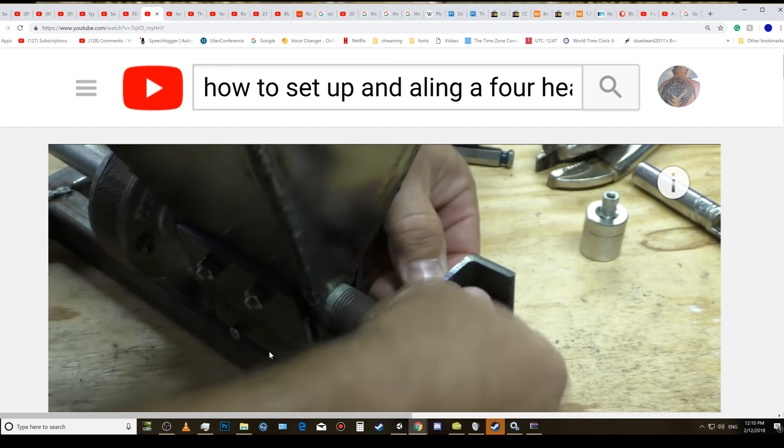You need the wood-style screw instead of the modern metal-style screw. These modern drills are designed for high speed. The old-style ones are designed to push a lot of product at a slow speed — because remember, those old drills were turned by hand and had to move a lot of material. That's exactly what an extruder is: the same as that old wood drill. It needs to go slow but move a lot of stuff.